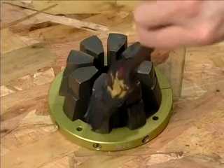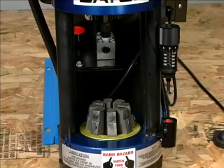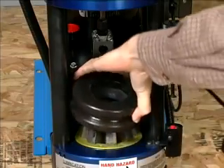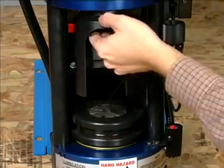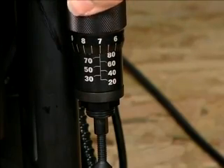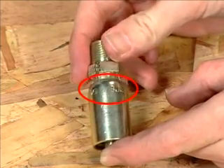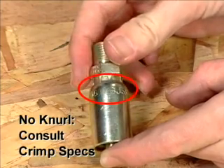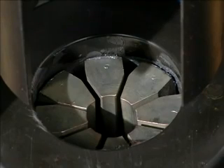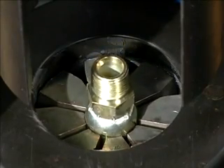Also lubricate the faces of the die fingers. Next, place the die set on the pressure plate. The ring goes on the bottom to enhance the visibility of the assembly being crimped. Lubricate the compression ring and place it on top of the die set. Next, attach the pusher to the stud at the base of the ram. Now turn the micro crimp adjuster gauge to the correct setting of 77. Some DECO couplings come with a knurl on the ferrule to indicate the crimp length. On ferrules without knurl marks, consult the crimp specs for the proper position of the coupling in the dies. Looking down from the top of the die set, it's easier to see the relationship of the die fingers to the ferrule location. Center the knurl in the tops of the die fingers.